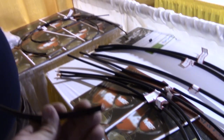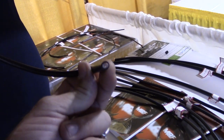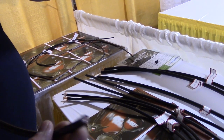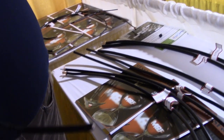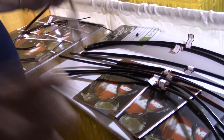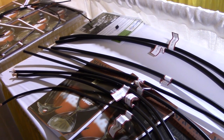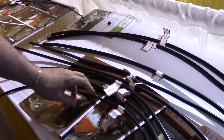This cable is 0.300 inches, while LMR-400 or RG-213U is 0.400 inches - so it's smaller but comparable in specifications to RG-8. At high frequencies it's actually even better than RG-8.